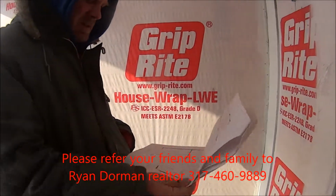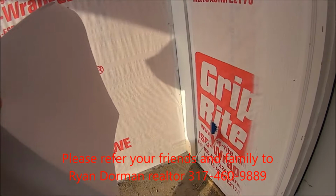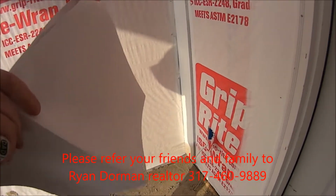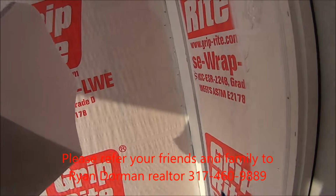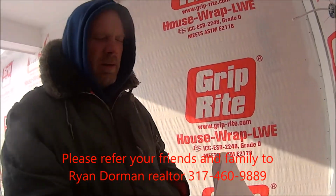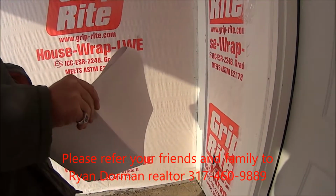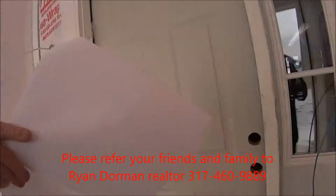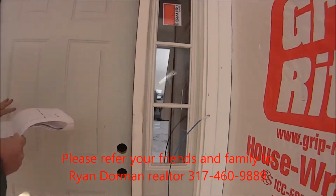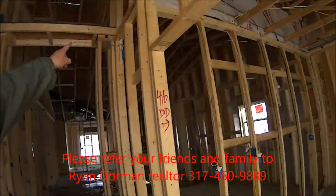Alrighty. So out here on your front porch, you've got a weatherproof protected GFI outlet, and you've got three of them outside. You got this one by your back patio, one by your air conditioner. They are all tied to the GFI in the garage. So the ones outside will not actually have the reset button, but the one in the garage will. Here at your front door, you do have a push button doorbell with your door chime right there mounted.